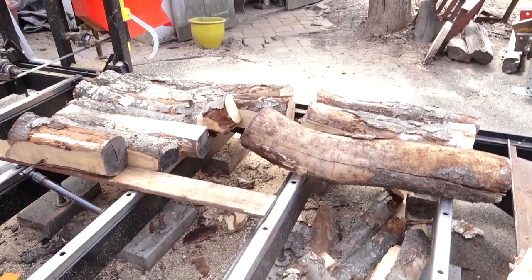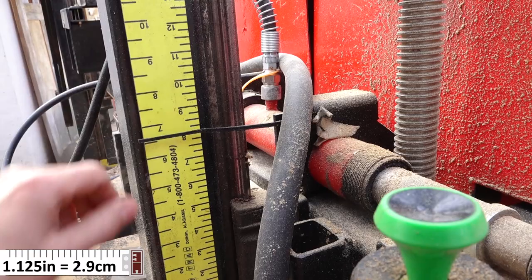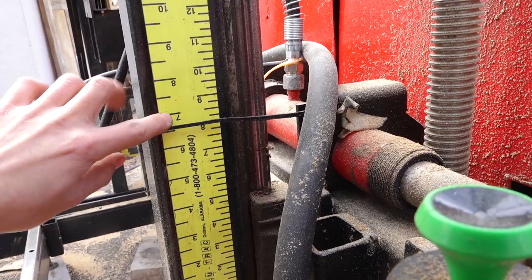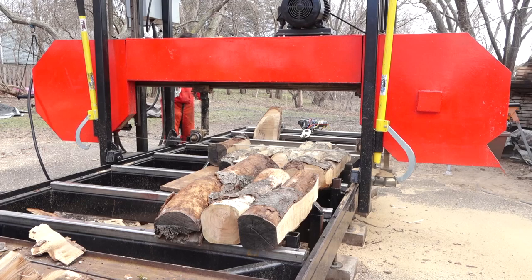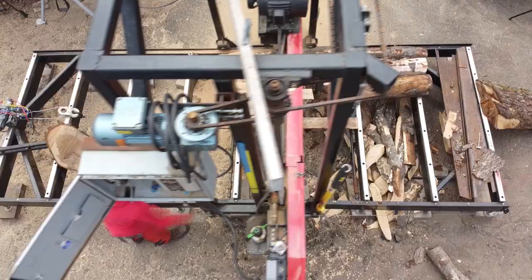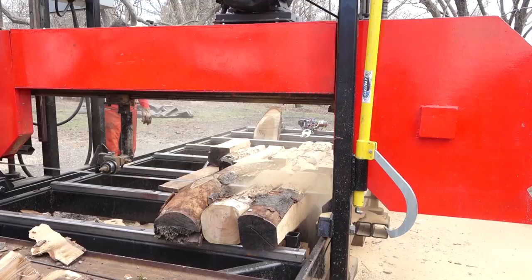Now with all these set up and ready to be cut, I can use the lumber scale on here to make all these individual cuts. This is a four-quarter scale, so each number is a board that's an inch thick. I'm going to do basically skinny six-quarter, so I'll go one-and-a-half markings on here. That won't be exactly six-quarter, but since this is all consistent it's not going to matter a whole lot. I'll come down, make a cut, remove the waste, and just make all the cuts all the way down to the bed. That'll leave us with a stack of boards.